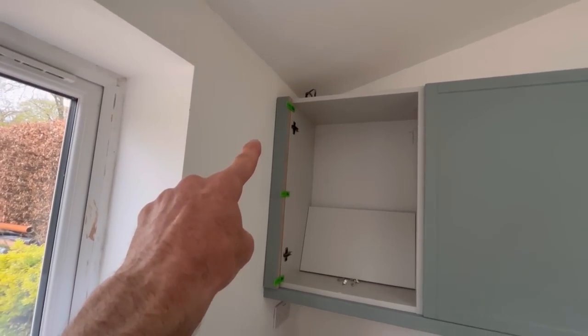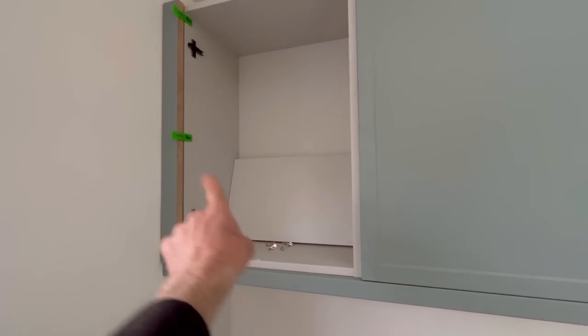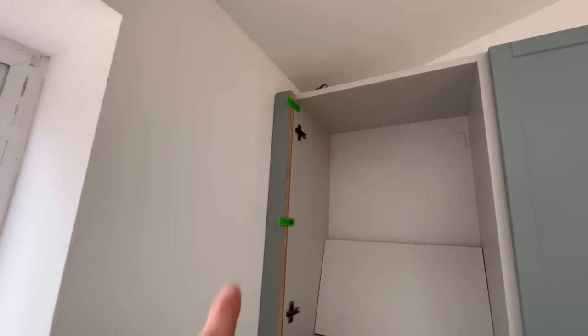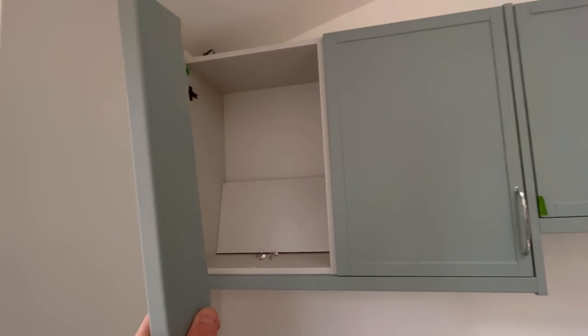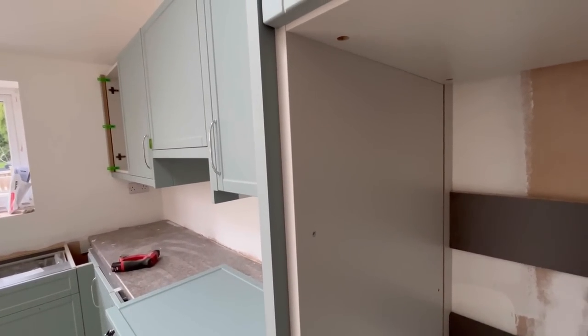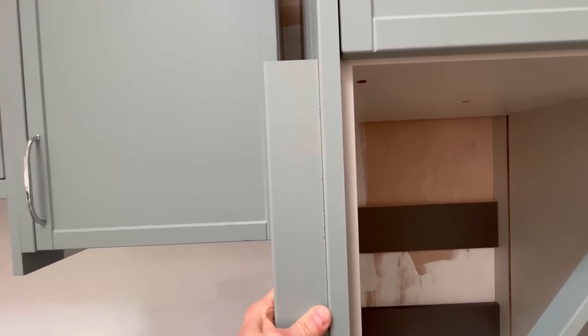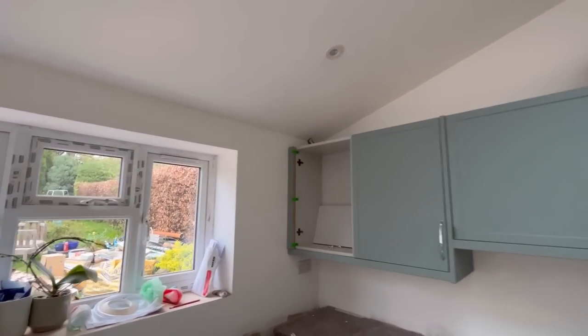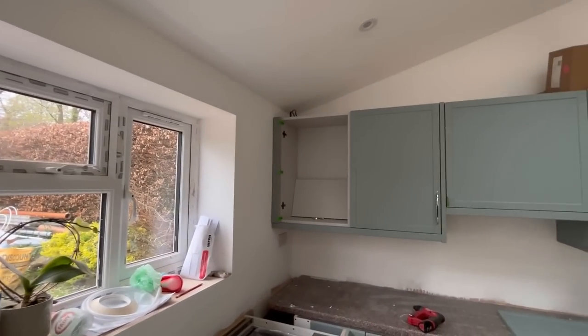And then you just get a piece, run it down the wall like that, or I'll probably use my Easy Scribe Trend jig, just in case you haven't got a piece knocking around. But then all I've got to do is minus off the thickness of this, because I'm going to put that down the side of the cupboard first to simulate that same thing there, where that comes to the face and then the door sits in that gap there. And then my scribe will sit like that against the wall. That's what I'm trying to mimic. So I shall cut that out now, scribe that down there, cut that out, take it on my little table saw outside, and then we'll see how that fits, shall we?